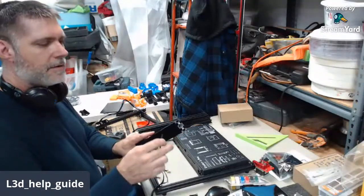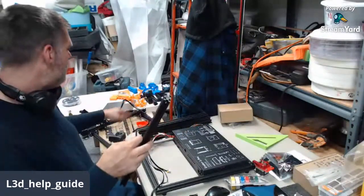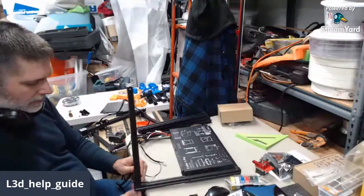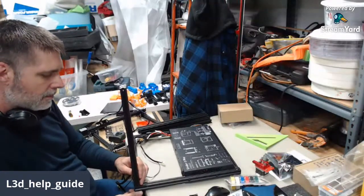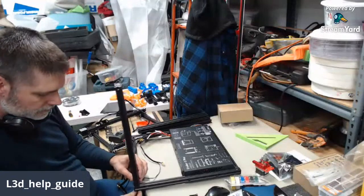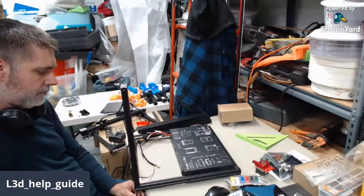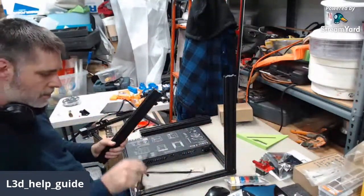And so for those who've never assembled one before, there's a machine threaded hole on one end and not the other. The threaded end goes into some brackets on the upper XY assembly. So you just want that end up away from the other end. Put them on one at a time.